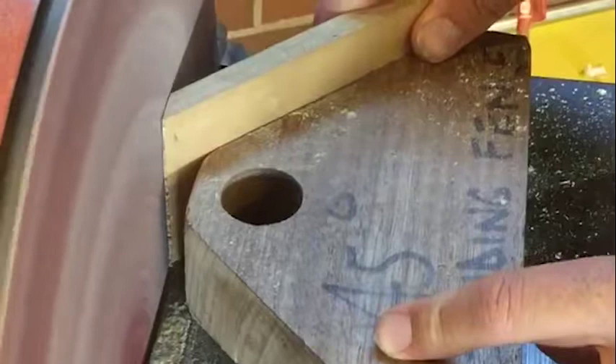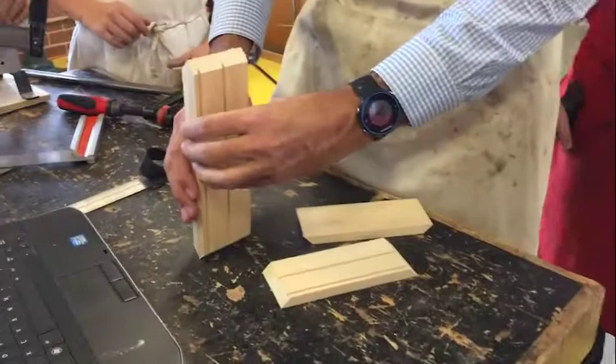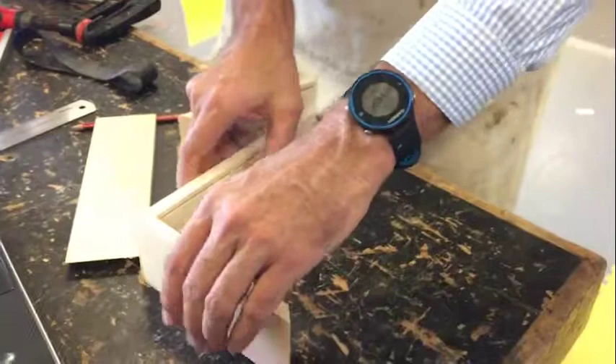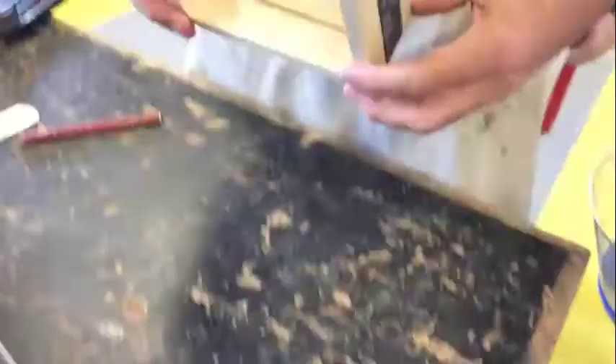Get it down to the line and you should get a nice perfect straight line. All right guys, next step: once you've done the disc sander and you're happy with all your pieces and you check that they are actually the same length — this guy's done it really really well, they're all exactly the same length and look very square — you do the visual inspection. Then we'll get the car tyre rubber band and use that to glue it together. Put the rubber band around there — oh that's really nice — and that force is actually pulling it into square.